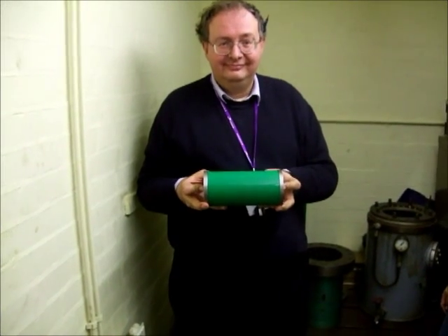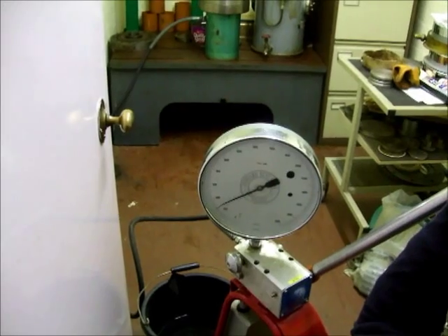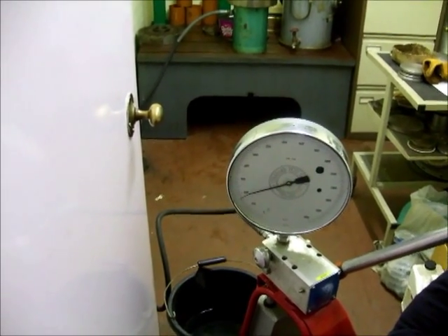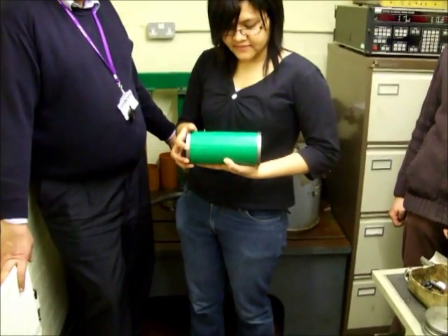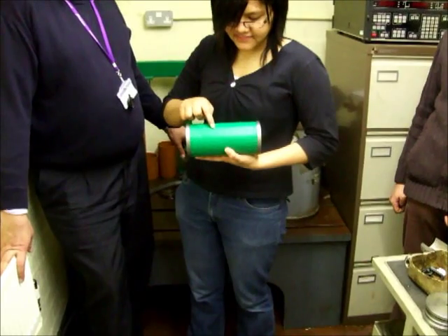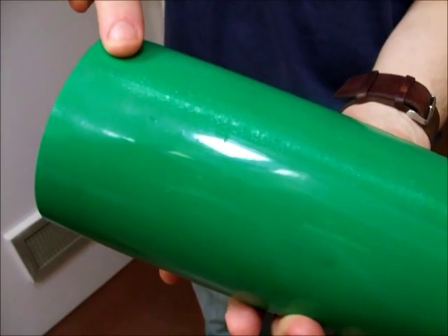So now we're going to test PTS G3, glass fibre. Here are our experimenters. Call out the pressure as you go along: 300, 350 — it's gone. PTS G3 collapsed at 350 psi. Could you show the fault line? That's a crack for PTS G3.